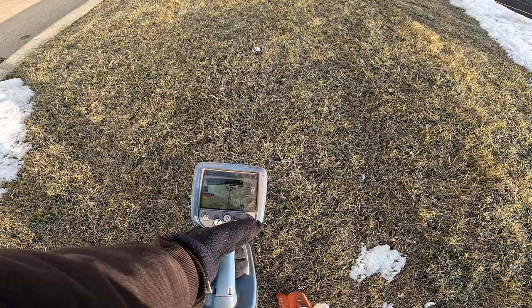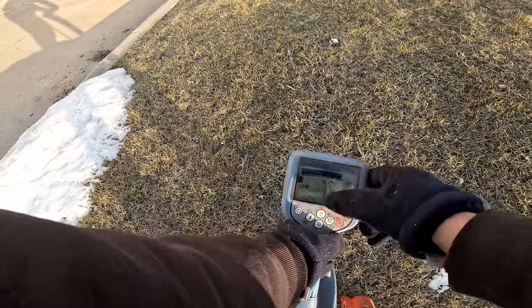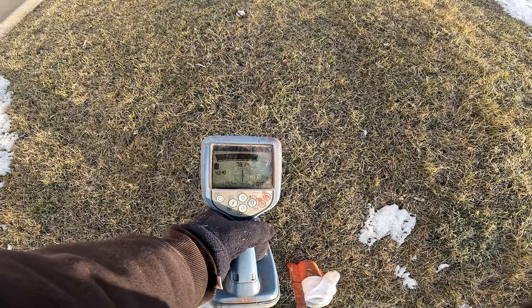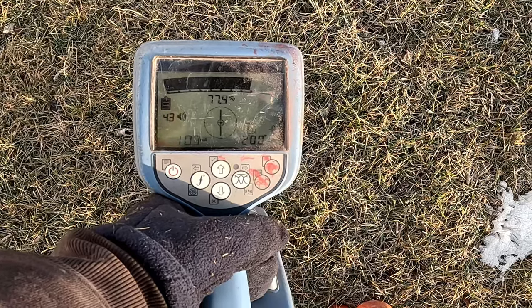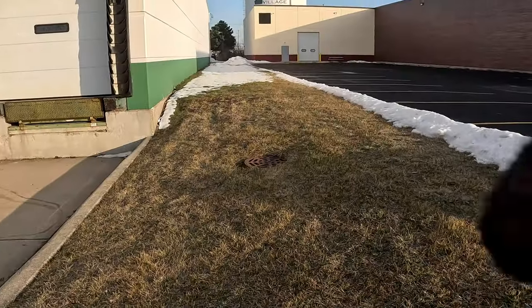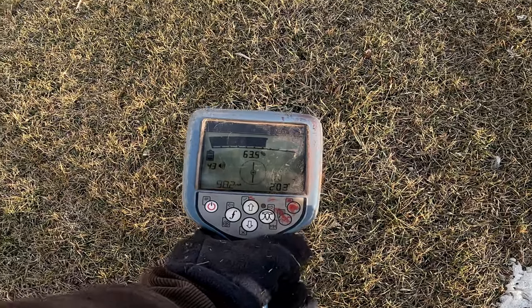I did a 360 sweep, and this is the only tone that I picked up. Right here, you can see it's a good tone. You can see it's at 2 feet. I don't know how good you can see it. You can see my milliamps. I pushed out 100, and I'm picking up 103. That's impossible. I don't know how I'm picking up 103, but I am. I'm seeing it with my own two eyes. So I got excellent milliamps. So I know this cable is going this way. So always start with your receiver below 50 and above 40, and you should be good.